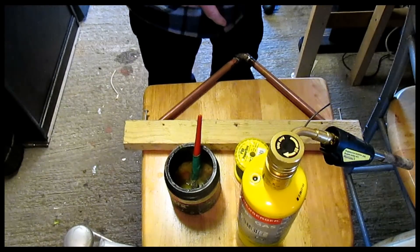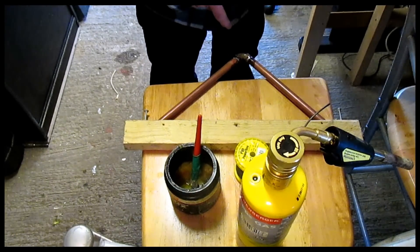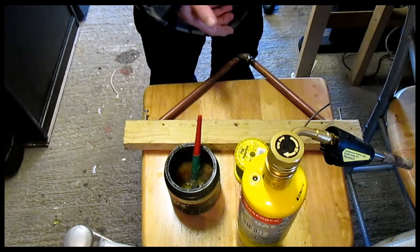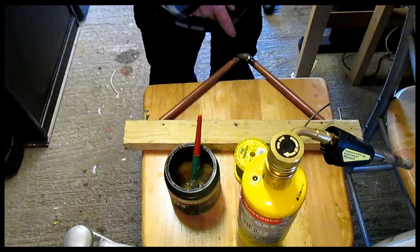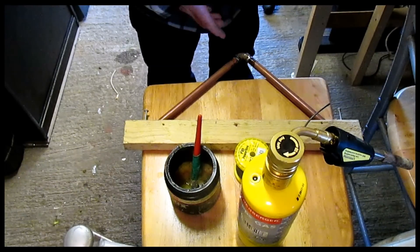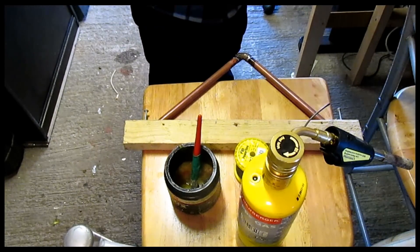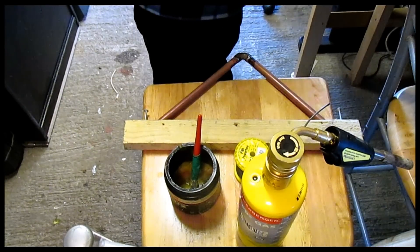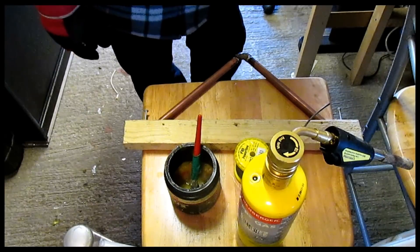If we just applied heat and put a blob of solder on, I'm 99.9% sure it wouldn't work. We have to take that joint apart and see what the problem is. So what I'm going to do in this situation is cut it out, so I can get that thing fully dry, know that there's no water inside, and get it properly apart. Get yourself a pair of these and cut this out from wherever is easiest.